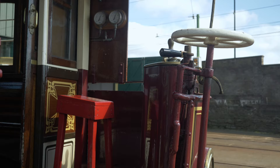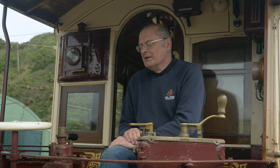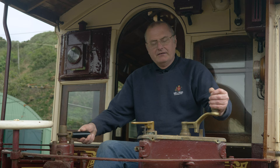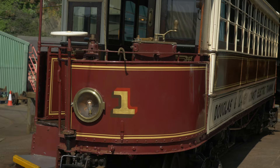There's not really much to it — it's not like the cockpit of a Boeing 747 with all those dials. That's all we need to make the tram work. To start the tram: the brakes are always on full, the key's forward like that, we give two toots on the whistle, we get a bell from the conductor, two toots on the whistle back, then let the air out and start to build her up through the points like that. Dead easy — best job in the world, driving one of these.